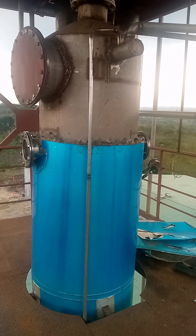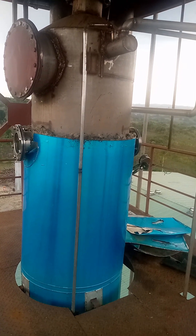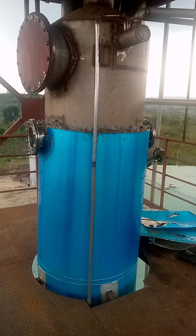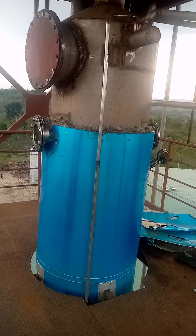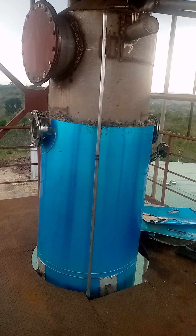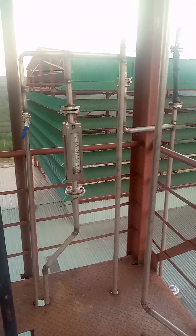This is a 10 KL per day plant, so we expect around 2000 liters per hour of reflux from the main condenser. The remaining vapors — around 20 percent — flow to the vent condenser, and around five percent are non-condensables which we take out as technical alcohol (TA).